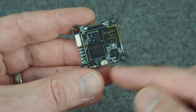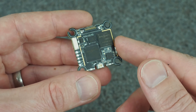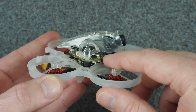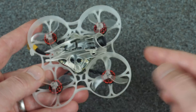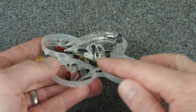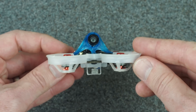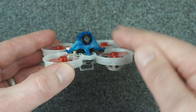I actually made a 3D model and printed it to test fit in different frames to make sure it would work before I recommended it to Carl, and the fact that he used it in the final design is really cool. A few things to point out: the sides are notched in, which saves weight on the PCB and also helps it fit into various frames. The easiest way to mount the video transmitter is probably to stack it on top of the flight controller, as they did in this 75mm HDZ Rebind and Fly build that Happy Model sells.